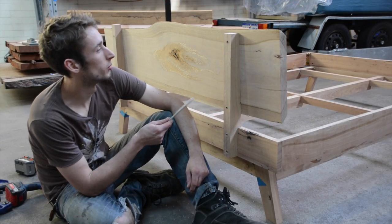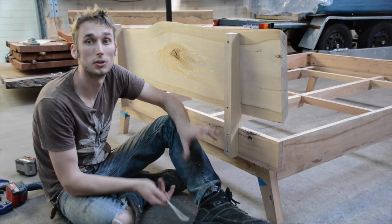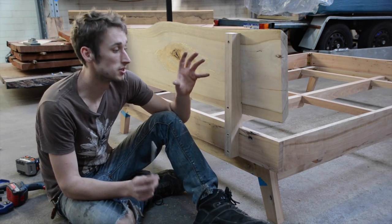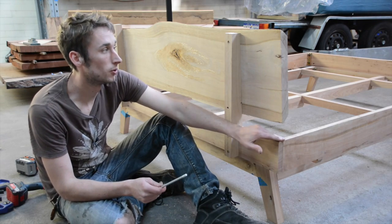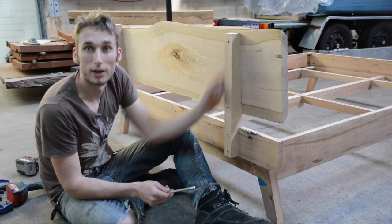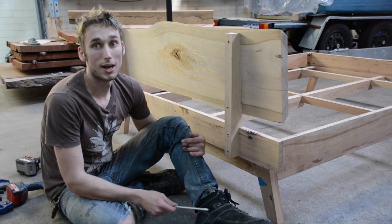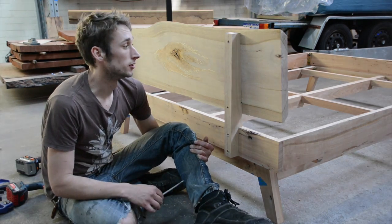The headboard is attached. What we still have to do is round over all the sharp corners, make sure nothing is sharp anymore, and do the sanding — that will be part of the next video, which is the third and final video on finishing. That covers filling all the voids, making sure all the joints are nice and tight, elongating the holes, adding roundovers where needed, and all of that. We have now finished the construction side of the bed; all that needs to happen is that plywood sheet which I haven't got in stock right now.